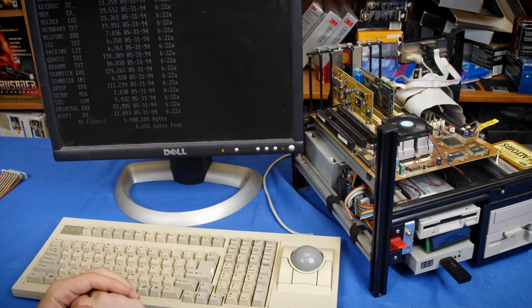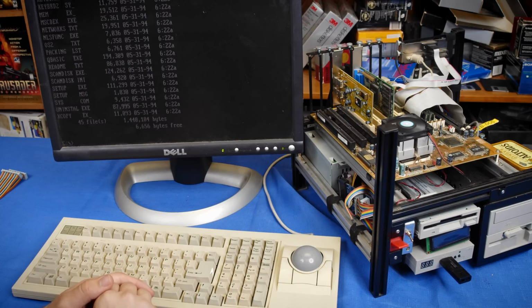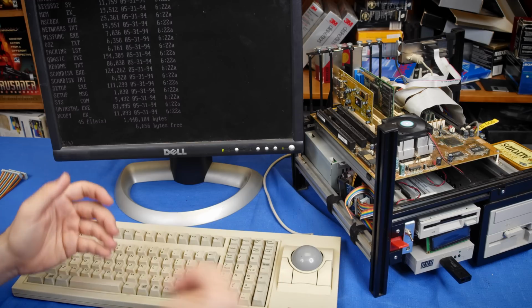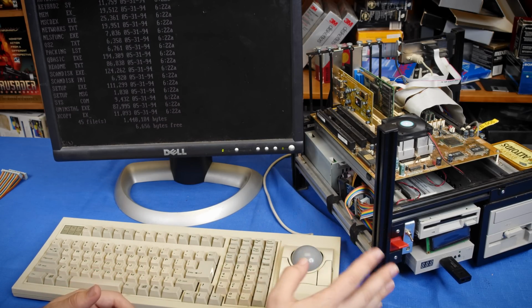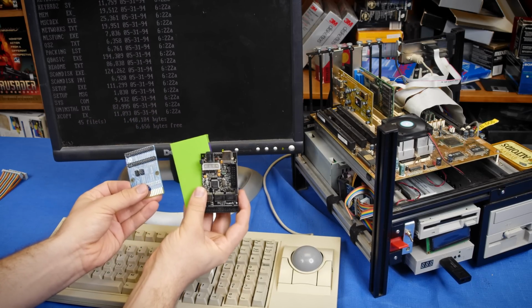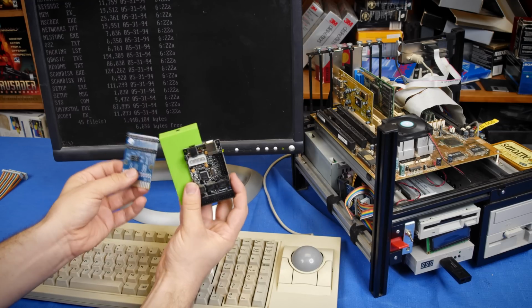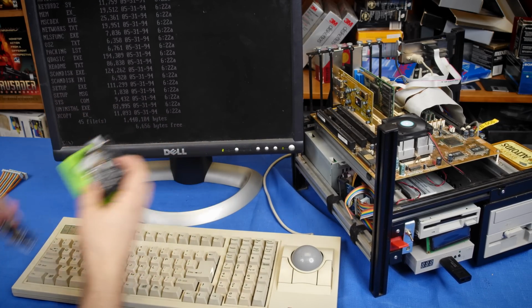And let's be real, on Windows 95 and 98, you probably don't need a bunch of weird virtual drive interfaces, because if you're doing anything with tons of floppy drives on those, you're probably doing disk imaging, and you'll have tools that will allow you to specify what the drive structure is independent of what the BIOS tells you it is. On that though, let's check out using this with disk imaging hardware, because this is one of, if not its best use cases, because this is just great.